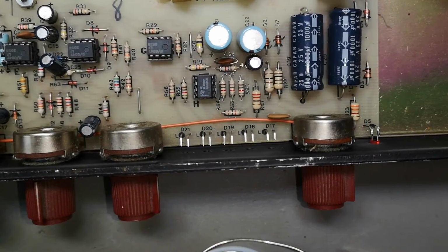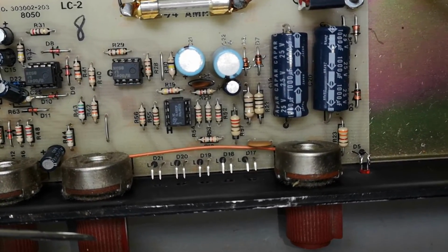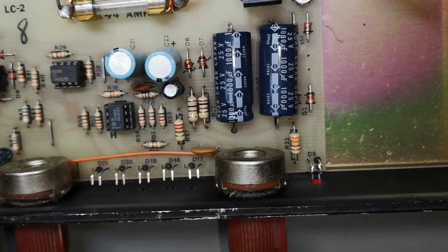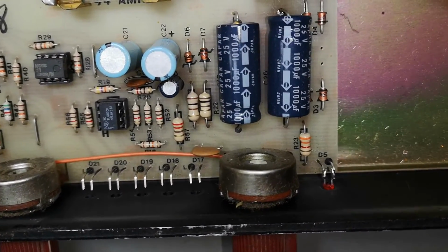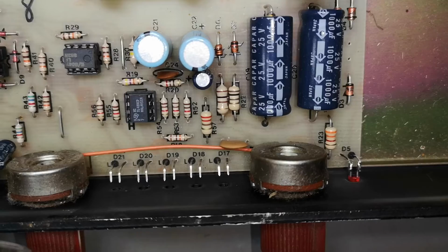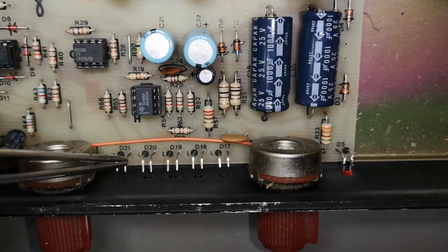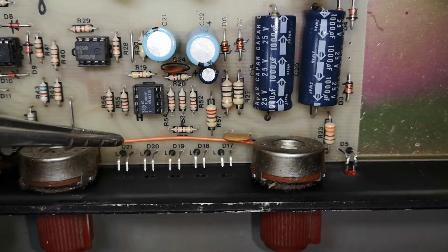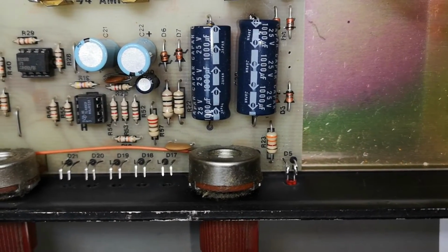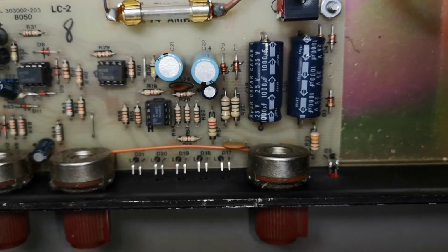Replacing all those LEDs was definitely necessary. They're super dim, and we need new and modern LEDs in. And this is what I would call a lazy man's repair job. I'm probably going to hell for this. I should of course not tell you how to do super lazy man's solutions, but if you just cut the pins of the old LEDs, bend them a little bit out, pull out the old LED, in with a new one, cut and solder like this, and bada bing bada bum, you're done real fast and real cheap, and this way you'll save your customers a lot of money.